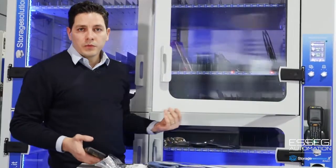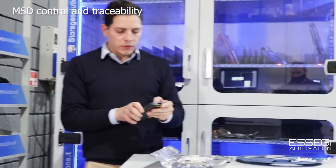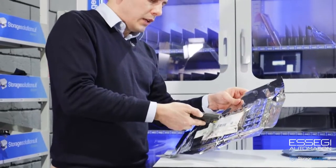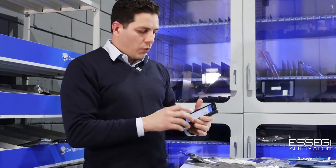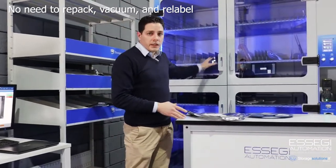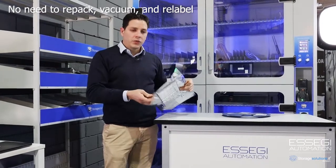All our equipment is equipped with humidity control. If this was an MSD component, when it comes out I start counting the floor life. The PDA also allows us to keep track of MSD components inside a bag — I can tell the software I'm going to take a component out of the bag, scan the unique ID, and set the reel out. That's actually a JEDEC tray. When it returns, customers use the towers and dry cabinets to store MSD components back, avoiding the need to repack, vacuum, and relabel the components.